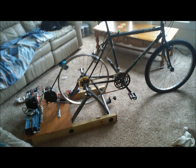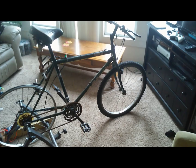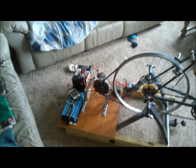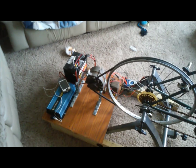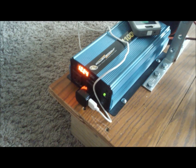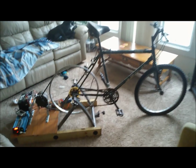I plan to make another video powering various things around the house with it — you can see that it works, putting out a good 14 volts of charging power. It's pretty simple to make; like I said, if I can put it together, anyone can. It didn't take very long or much planning, and I'm no engineer. It's really nice having this battery in the system because you can ride it for a long time and charge the battery up, and then use it to power smaller items when you're not riding the bicycle. We've got our phone plugged into the inverter right now, sitting at 12 volts and it's charging the phone. Overall pretty simple and worth giving a shot — at least a good science fair project with your kids.